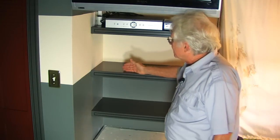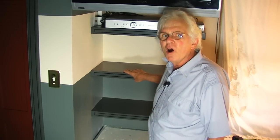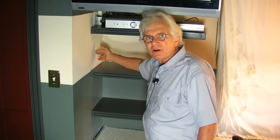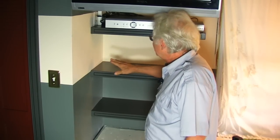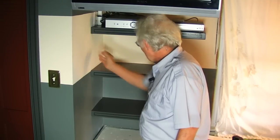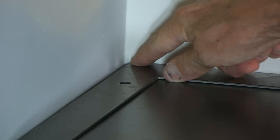During the process of building these freestanding shelves, I ran into a problem you often encounter in old homes: these two walls are not square to each other. I needed to line the edge of the shelf up with the wall. Placing a square on it, we can see that the shelf runs off from front to back about 3/16 of an inch.